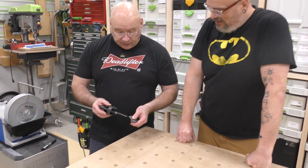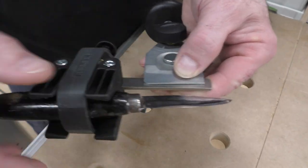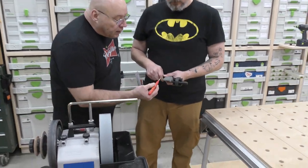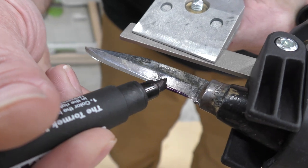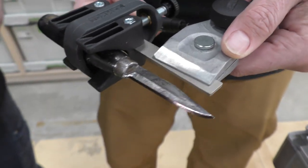We'll take the knife sharpening jig, slide it in here, and I always follow the slight angle like this. The first knob I tighten is this one, and then I tighten that. I'll have you just mark that front edge right there so we can attain our bevel to our stone. Mark both sides — I always mark both sides.